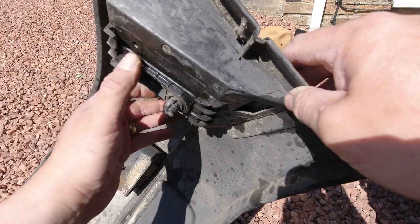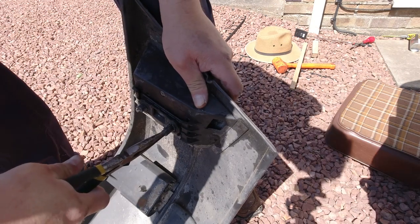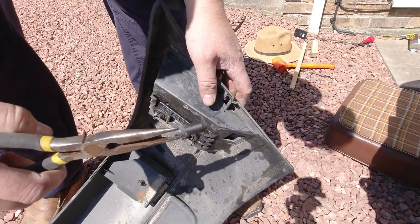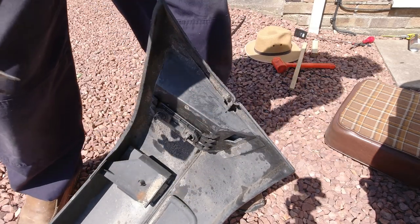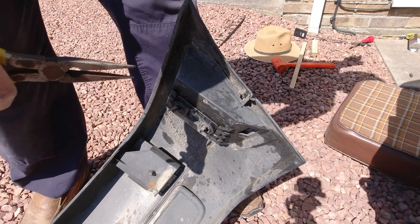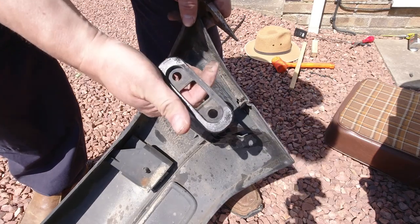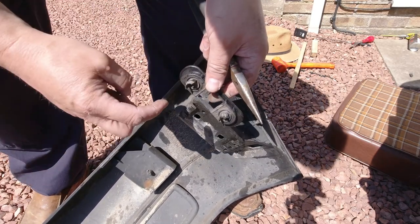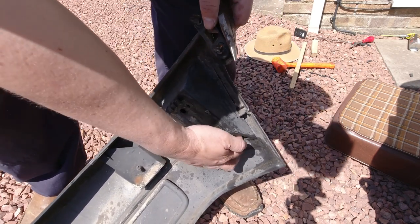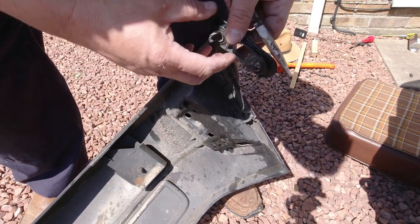I think they just pushed too far in, so it's not able to slide back. I'm going to pull this dowel out and see what happens. There we are - just a black plastic slug. Now that slides out, so that's purely caused by somebody trying to remove it by poking those dowels through, which locked them in. You can punch them through and try to fish them out, but the whole thing should just slide off.